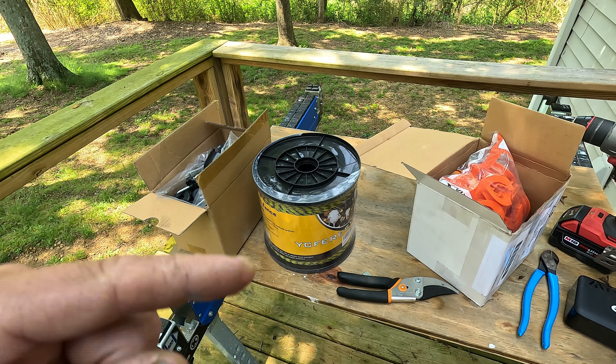I think we'll start here on the wooden post — put a couple eyelets in, maybe three or four strands — then go up to the corner and over to that gate, where we'll have to dig under and run underground wire all the way around. The gates I'm gonna have to get some hardware cloth and metal zip ties so the goats can't squeeze through. The wire is actually on the outside of the pen, so we're gonna run electric on the outside putting it into each post. I'll tie a pigtail off the end to splice into the electric cable.